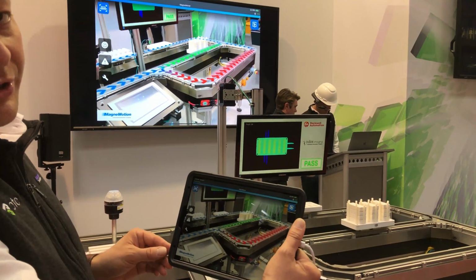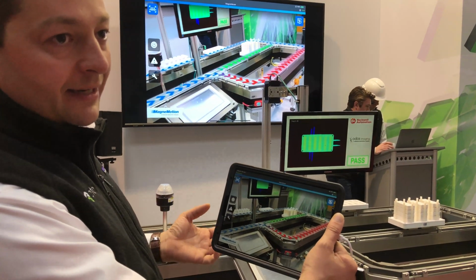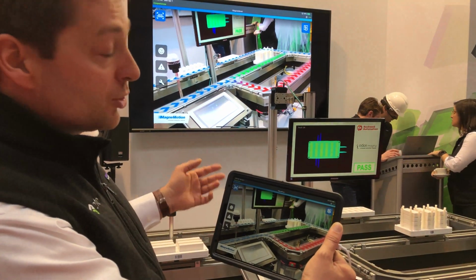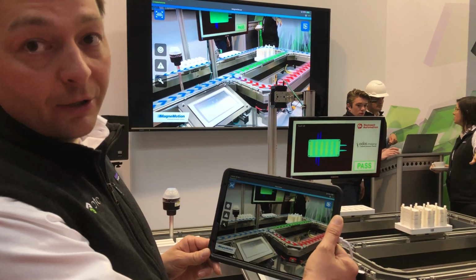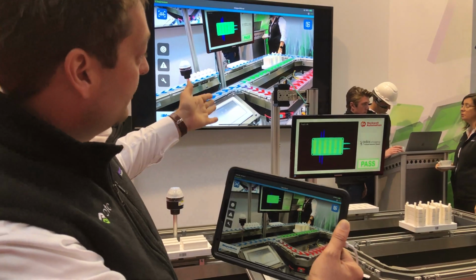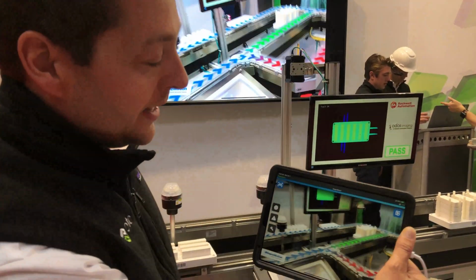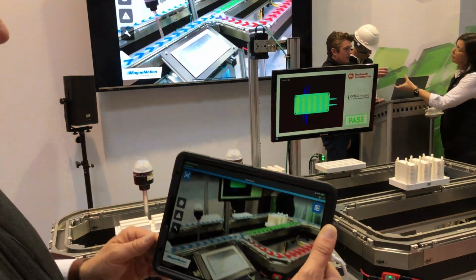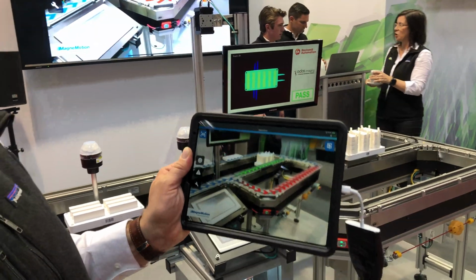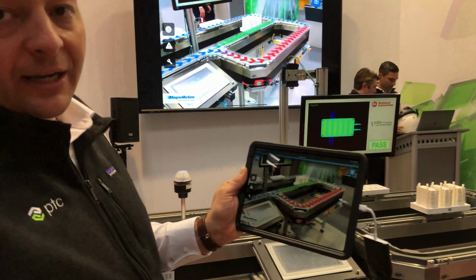The MagneMotion machine works in a way that components, let's say in the medical industry, we ship certain components, the packages are built, and there is an inspection on the package. So the machine scans a barcode on the mover, and then has a 3D scanner on top of it, which is right here. It identifies what components are going on, and in case everything is okay, or as expected, it takes the middle pass right here. If something needs rework, it automatically splits it off to a different track. That's the red track we have here.